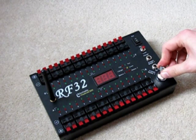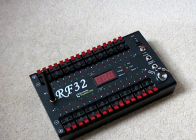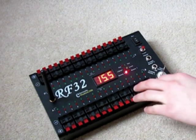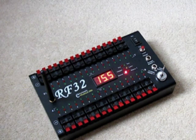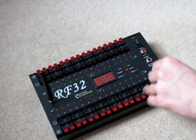If I turn it on by rotating the arming key, you can select the external battery — which we don't have connected right now — or select the internal battery, and you'll see the system comes on and displays the battery voltage on the display. You can't remove the arming key when you've selected internal or external battery, so when the system is switched on and armed, you won't be able to remove the key. This is a safety feature: if you have the key on you, the system cannot be armed. The only time you can remove the key is when the system is in the off position.